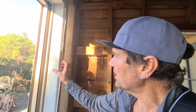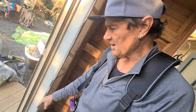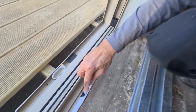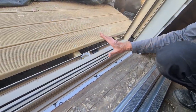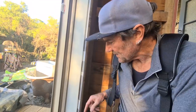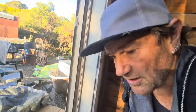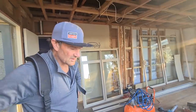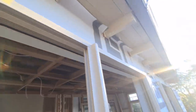The water that gets behind the door goes down into the flashing and empties out below the door. Any water that comes in any other way still goes down the protected side and out. Belt and braces. The doors are in loosely — tomorrow when the polyurethane sealant has set, I'll pop the door out and run more polyurethane sealant in so water can still run out. This forms like a pond at the back. I don't drill or screw through the bottom at all — only through the sides and top. Then I'll put a foam backing rod all the way up and foam the whole way between it.